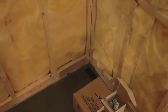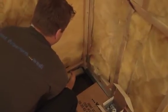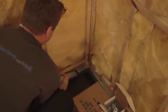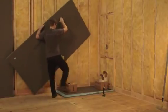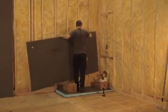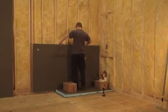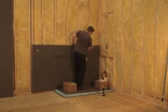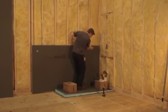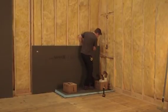Before WEDI building panels are installed into the Rialito base channel, a 1/2 inch bead of WEDI joint sealant is continuously applied in the channel. Here we use a 20-ounce unit of the WEDI engineered MS polymer sealant and WEDI sealant gun. The WEDI joint sealant is not only a strong and flexible adhesive to bond all assembly parts, but it is also a waterproofing sealant to last for decades without aging-related changes in performance in even submerged applications. Make sure to remove any thinset mortar or other contaminants from the channel before applying WEDI joint sealant.